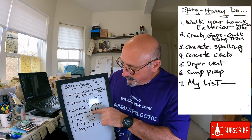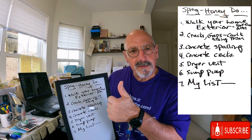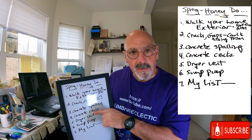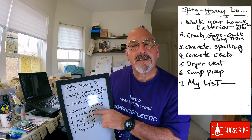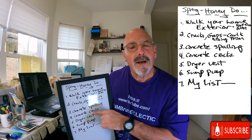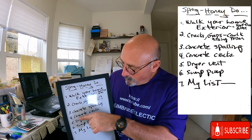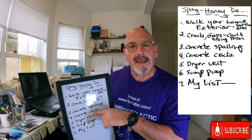I also walk around and look for all the concrete steps, concrete driveway, concrete patios. I'm looking for any cracks, and if I see cracks, I want to use a concrete caulk, not a regular caulk, a concrete caulk, and fill in the cracks. In the winter, cracks can develop, and then water gets in there, it freezes, then it thaws, then it freezes, then it thaws, and that just makes the crack get bigger, bigger, bigger, and it causes more damage. So you want to fill in and seal that up, and you want to check it again in the fall as well.